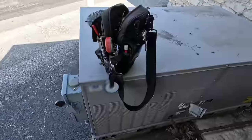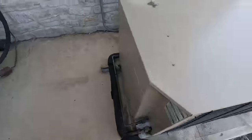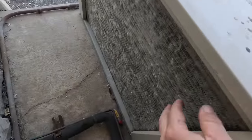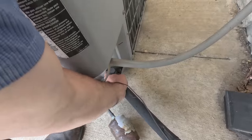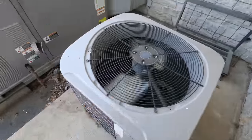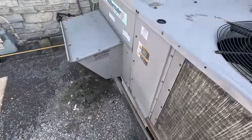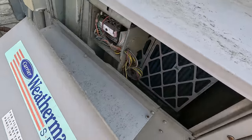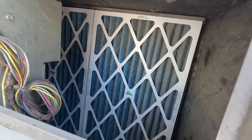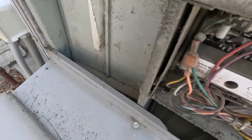Hopefully this is an easy one — it's the end of the day and I want to go home. This is a little gas station. We've got the cooler that's getting all hit up with the cottonwood, which is starving it out, but that ain't why I'm here. I'm here because it's warm inside. The split air conditioner is pumping out heat like crazy. Suction line's cold. What's probably killing us is the package unit here that's not running. We've got filters that are kind of dirty, the fan is running, and the economizer is closed.